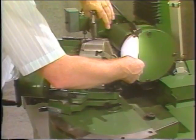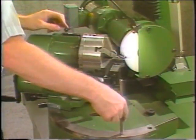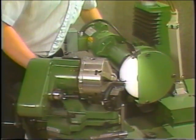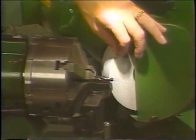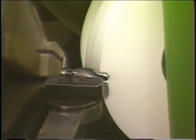Just set the lip of the drill out in a convenient spot and bring your grinding wheel over. When you're grinding these, make sure that you have a nice sharp corner on the wheel — you don't want too much of a radius. It may help to use a finer grit wheel for this type of work to hold the form in the corner. You don't want to make too much undercut, just enough to put the radius of the wheel behind the land of the drill.